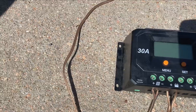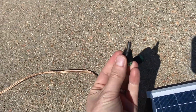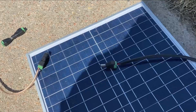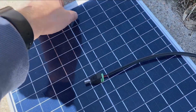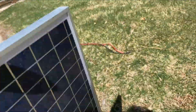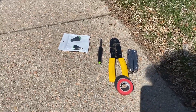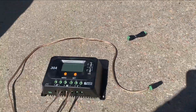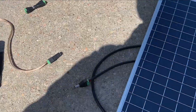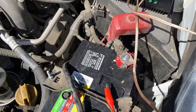On the solar panel cable we've got these handy DC jack connectors, just got those wired up to the speaker wire. I've got this end over here and this end over here. This is a 25-watt solar panel, I think about $25. This is all pretty easily acquired stuff. These are the tools I used — the Leatherman instead of scissors to cut the tape. I just wanted to see how fast I could put this together — took me about five minutes to wire it up. We're going to go ahead and plug these leads onto the battery to get this charge controller powered up, then plug in the solar panel and see how things look.